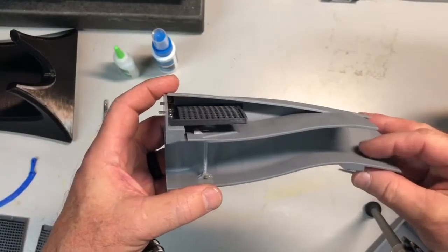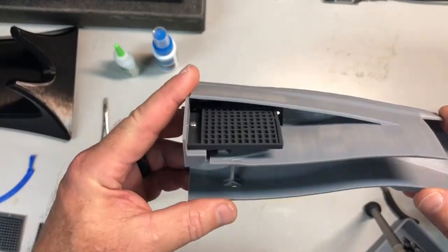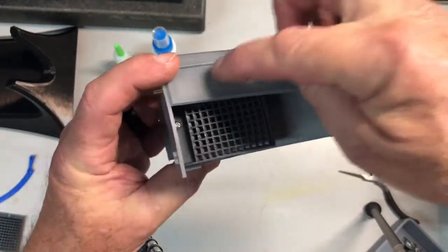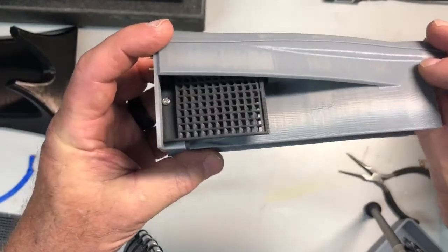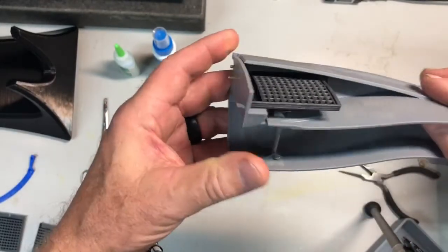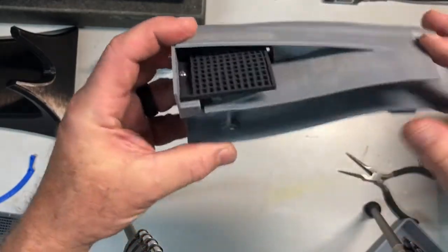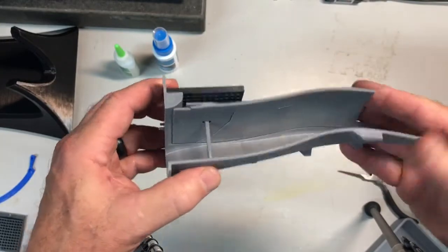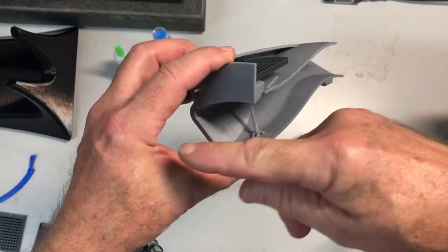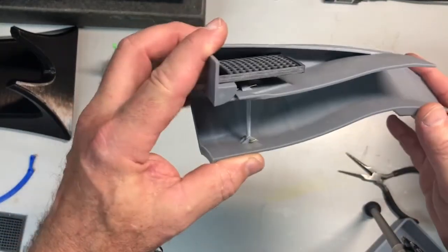Before we get started I want to show you one of the prototypes I built to prove the concept out. I actually went through about three prototypes like this before everything fit. What you see here is the inner cowling, the transitioning cowling or trans cowl — see the way they move together — the blocker door, blocker drag link, the slide pins, and the cascade. It's cut away so you can see what's going on. Basically this is a cross section of the thrust reverser.